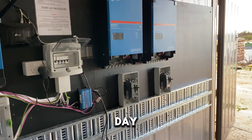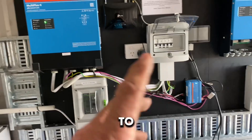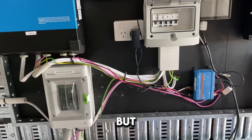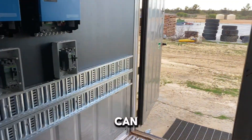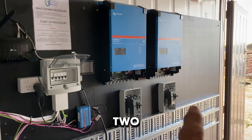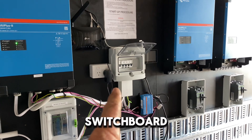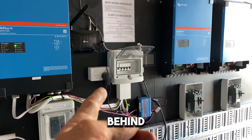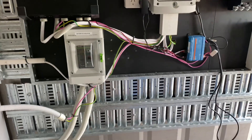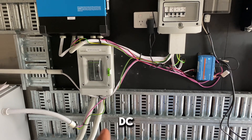That's the end of day one — a bit of a short day. Essentially what I've had to do is get the power back on, so I had to remove everything and do a few temporary things. I've put my two extra inverters up, spaced out to retain the area for my new switchboard, since all my cable entries, generator and power points are behind that board. I've run some cable trays — one for DC and one for AC — because of DC and AC segregation requirements.